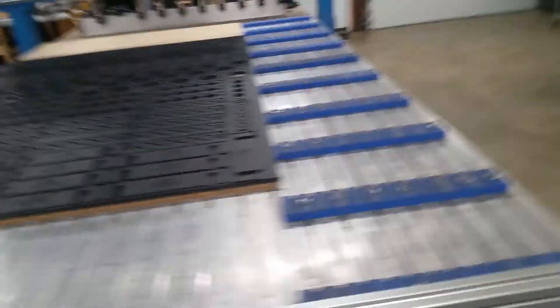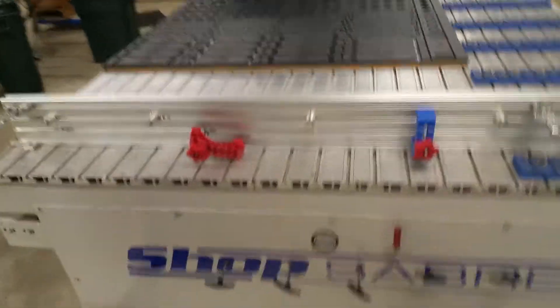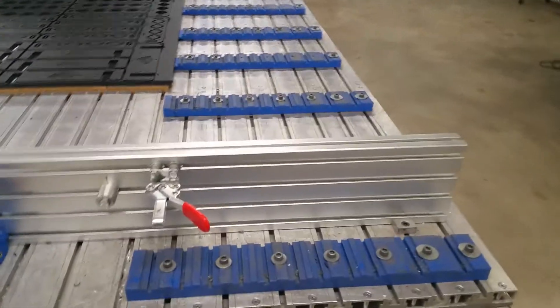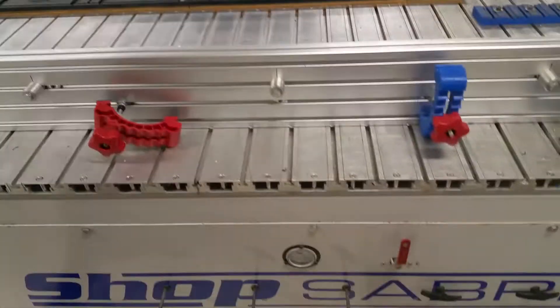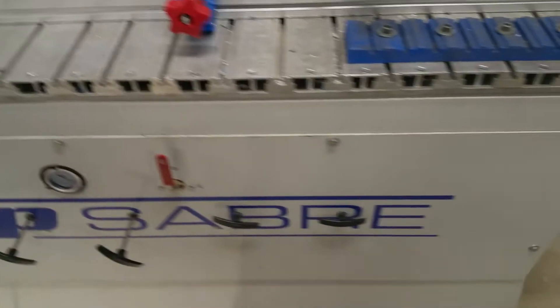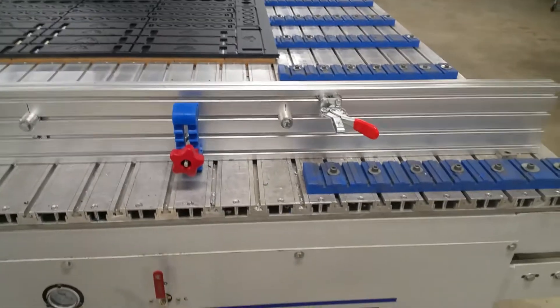Here's one of the fixtures I use for drilling the edge of parts — it's simply bolted on and has stops so it's always in tram; I don't have to tram it in each time. You can see this extrusion table that I bought and installed myself — it's mounted to a piece of three-eighths or half-inch 6061 T6 plate.